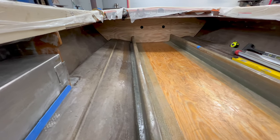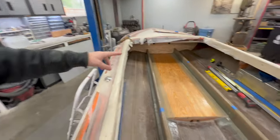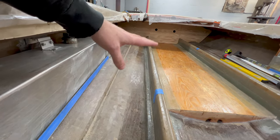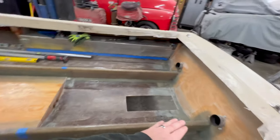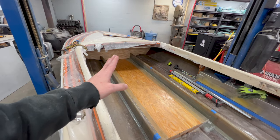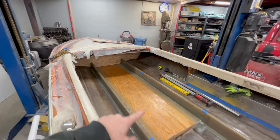That wasn't too bad — in the end I was able to finish all my trimming on the bulkhead, got it cut, and got it installed. One of my biggest concerns with making this bulkhead in one piece versus the two-piece bulkhead that was in the boat before was whether I was going to be able to get it in position given the complexity of the shape. I'm pretty pleased that I kept a pretty minor gap all the way around and it was easy to get in and out of the boat and get it positioned. To position it I pulled measurements from the back of the transom up to the bottom of the floor and made sure it was equal from side to side so it was essentially squared on the bottom. Then I just took a small level and placed it on the plywood and made sure I had it level going 90 degrees to the floor.